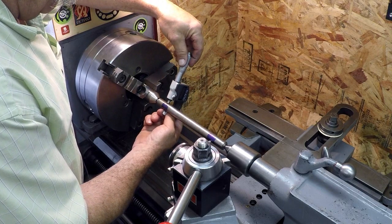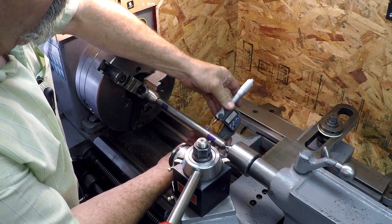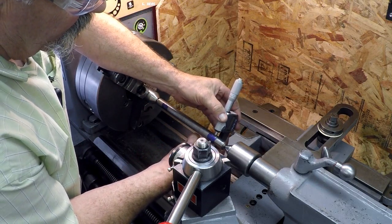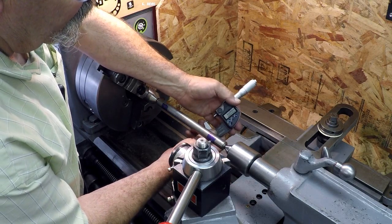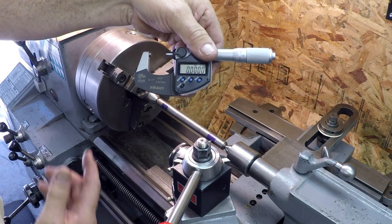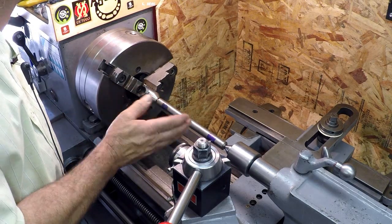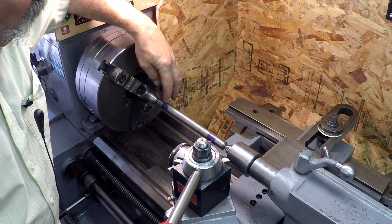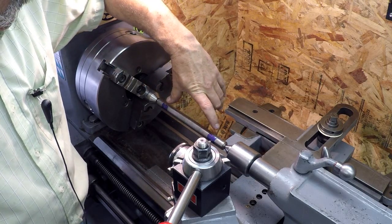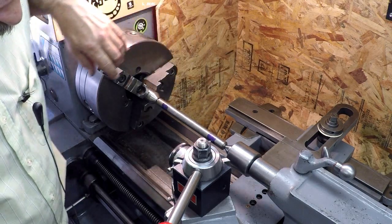So we're going to measure the diameters at this mark, and that's at 000, and this bar is actually pretty good, even though I turned it on the lathe to make it a test bar. It's 000. The bar has, for between those two marks at least, 0 taper. So you need something pretty good, or you need to know what it is. So we're looking for 0.1506 from mark to mark.